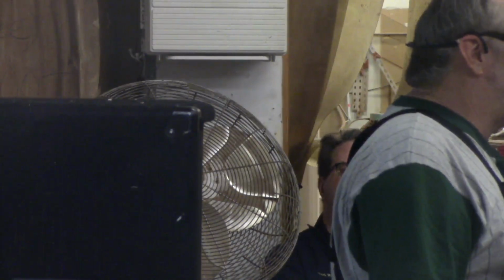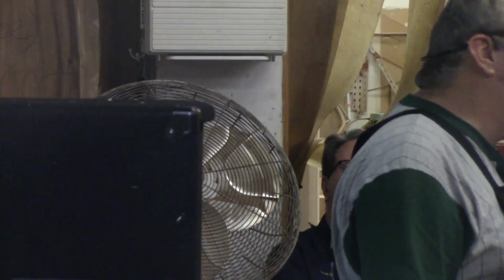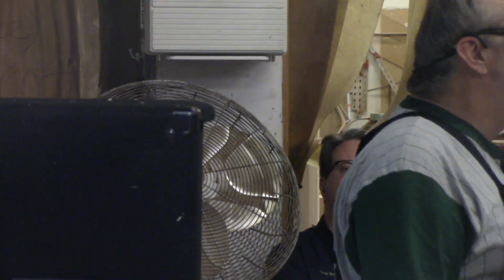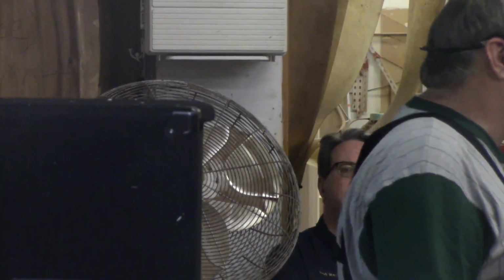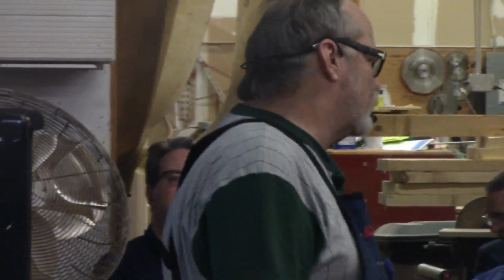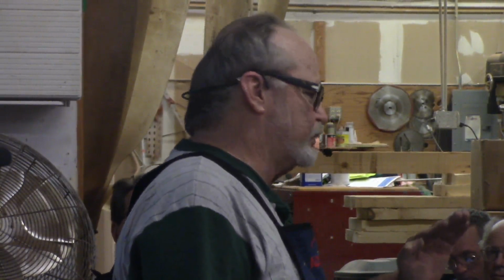Okay. Well, here's why I don't teach it. If somebody needs to be taught, and there are people who need them, okay, don't get me wrong, I don't give you an F in a class if you have to use a grinding jig for your bowl gouge or something. But I find by Thursday of a group of beginners, many have never turned before or ground tools, they're using all the tools freehand. I call this freehand grinding. I'm using a platform, okay? That's not really a jig, other than an angle, and on some tools it has no value at all.